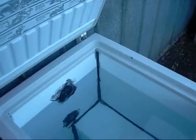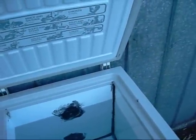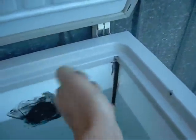tank. And they're pretty well sealed. They're a very solid unit. They're designed to actually hold water. Like, if it's fully iced up and defrosts, it's not designed to leak on the floor. But just for extra precaution, I've sealed anywhere where they've rolled and crimped the sheet metal shut on the cabinet. I've just lined it with a bit of silicone and just covered up the basket holes.